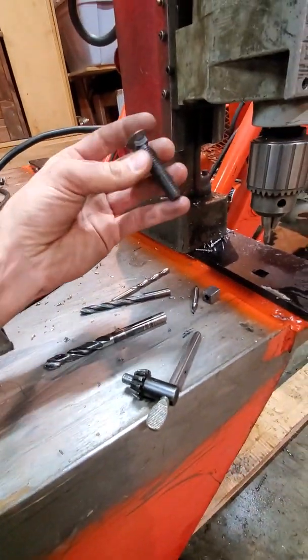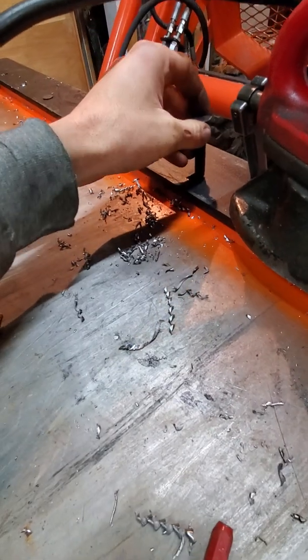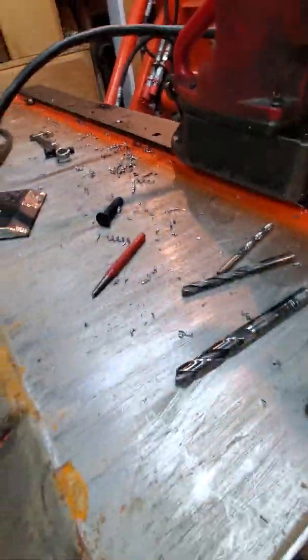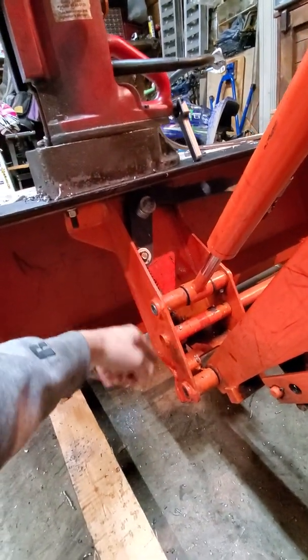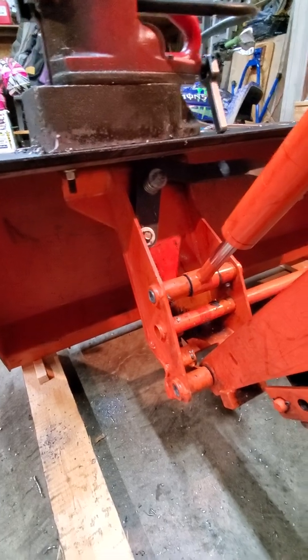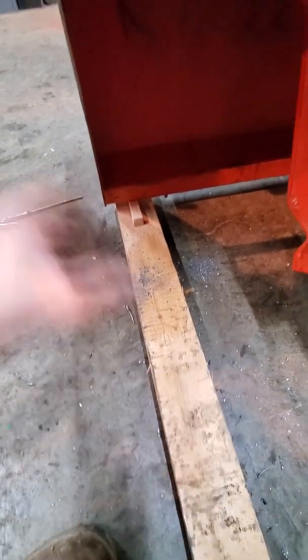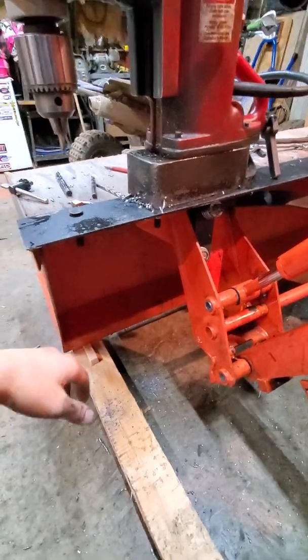The bolts I had to use were the 1/2 inch for this bar, if you choose to use the same bar. They just slip right in there. I've gotta countersink them the rest of the way and finish the blade up. I didn't have jack stands, so what I ended up using was the tractor loader arms. If you have the pin-on bucket, I'm not sure how it'll work, but with that quick attach, I just braced up some boards to stop it from teetering, because I got the hitch mounted to the center, and then used this from the mag drill, tipping it forward.